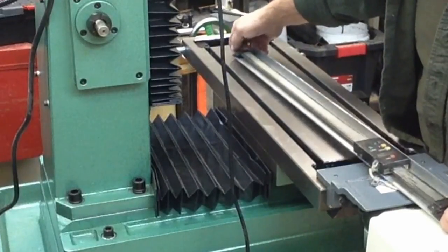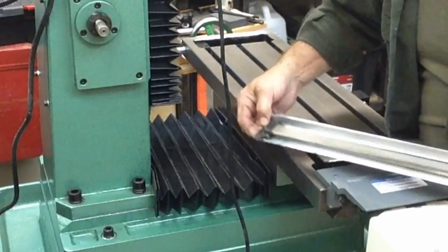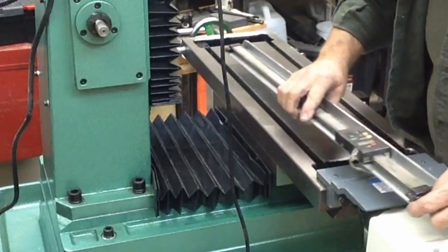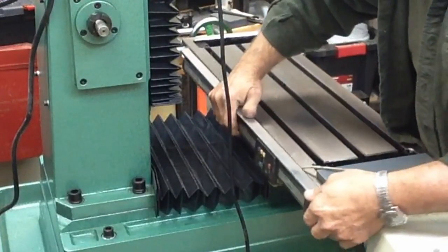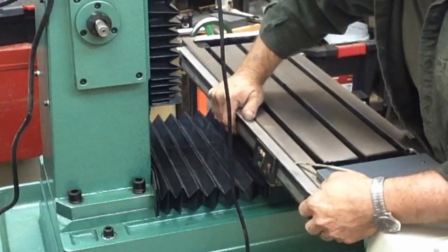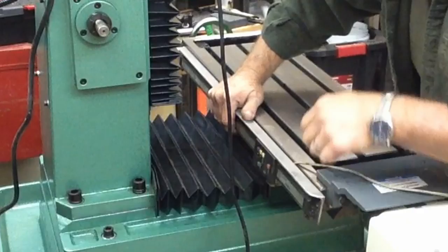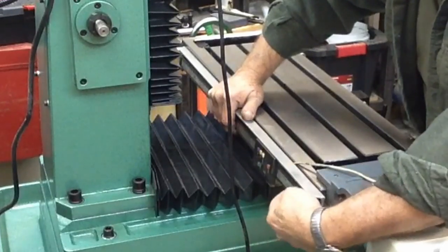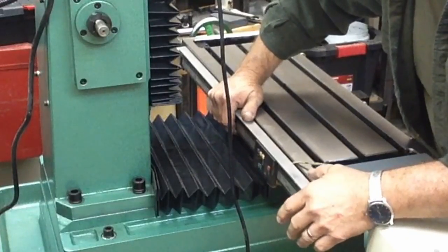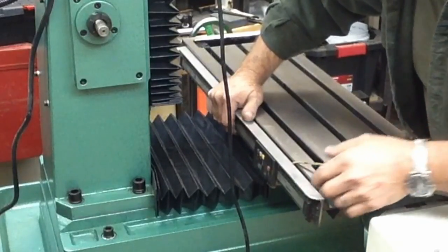We're going to mount our scale solid. Now on one end, we're going to use our mounting hole that we've got here, and we're going to drill and tap it directly into the back of the bed. And on the other end, we're going to extend beyond the bed itself with this. So rather than shorten up the scale, I'm just going to bolt these two together because we've already got alignment there, and then I'm just going to drill and tap someplace, probably just at this end of the table, into the table and mount the aluminum angle there. So the aluminum angle's the mounting point, and then the scale's going to mount to the aluminum angle. That's basically the way it works.